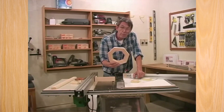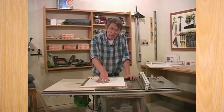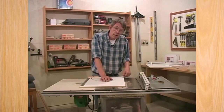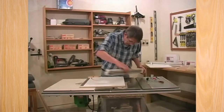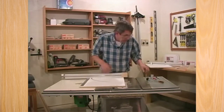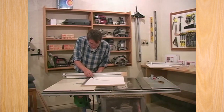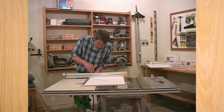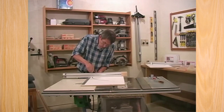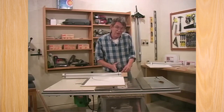Now that we've got the left side set up, we're going to show you how you set up the right. I've taken this jig, cleaned the platform, installed the mylar strips. We know the blade tilt was right — I ran it through, cut it, and broke the edge top and bottom with sandpaper. We're going to set the backstop on. I checked the end block, shimmed it the way it needed to be, and we're going to do the same thing we did on the left — get the T-nut set into the end of the backstop, get the arc, and pull that against the positive stop. I've got my clamp already assembled; again it goes to the right side because it's a left tilt saw.